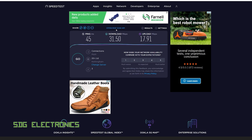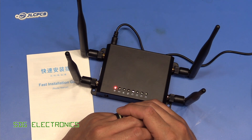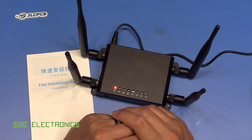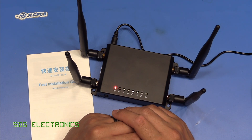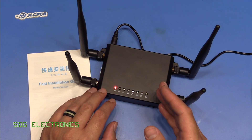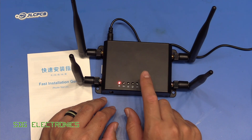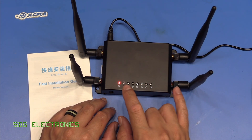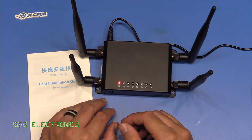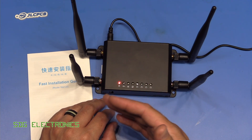Back in the lab just gone midnight, the speeds are considerably different — much higher upload and download — suggesting Three's network is congested where I am during the day. One limitation I found is there's no way from the web interface to set or even view which band you're connected to. You can send AT commands directly to the modem over SSH, but I couldn't find a way to drop from band 20 — which on Three has low bandwidth — back to band 3 or band 1 where there's 15 or 20 MHz bandwidth for higher speeds.